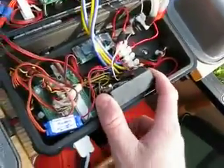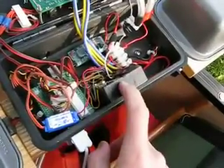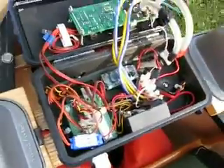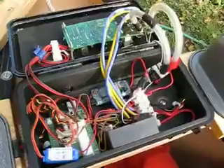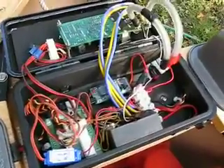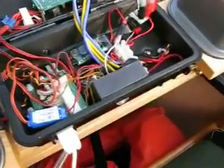The other thing I have in here is this solid state relay, which is kind of overkill — I just happen to have it around. It's a DC to DC. What this is allowing me to do is switch power on and off to the servos; it's switching the 12 volt power that's feeding the servo power supply. The reason I'm doing that is from the Arduino I actually want to be able to turn these servos off. These are digital servos and they are really chattery. As kind of a hack, once I built it all, when I'm cruising it's annoying because I like just the quiet and the sound of the water. So I added that piece in so that I could shut the power off to them, and then they fire back up as soon as I actually want to turn the motors.